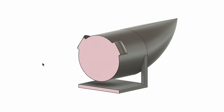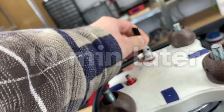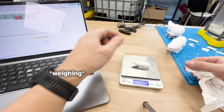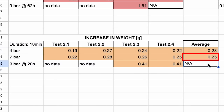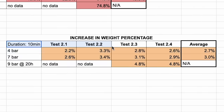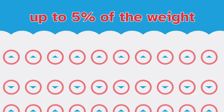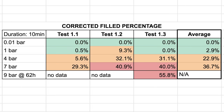This model is filled with plastic, with no space inside. After doing a couple of tests and checking the weight, after 10 minutes about 0.25 g of water is inside the walls, and after I left it for 20 hours it's 0.41 g — that's about 3 to 5% of the entire weight. That's surprising. I didn't expect that much water to be in between all of the layers. We can correct the previous table, and either way it's definitely not good enough.